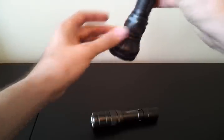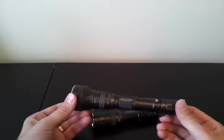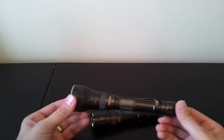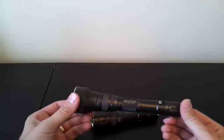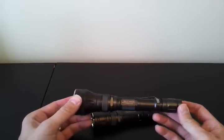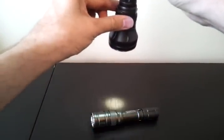This basically means it's not a visually linear control ring. The control ring most likely functions in a current-linear fashion, which means you spend most of the time near max output levels and very little time in the low output levels. I personally prefer what people refer to as a visually linear or logarithmic ramp in output. Our eyes and brains respond to different light levels in a non-linear format — most people see it as logarithmic, though recent research suggests it's actually more a power relationship with a cube root relationship of output to perceived brightness. My complaint is that this doesn't go down to as low a level as I'd like, with very little differentiation at low levels before hitting very bright levels.